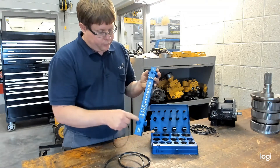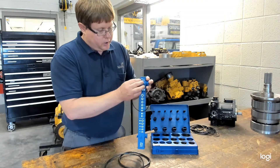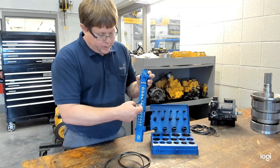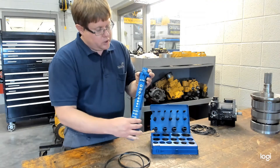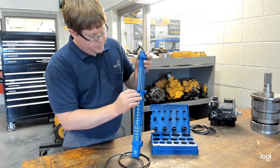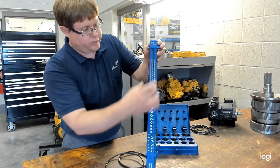On this tool, there are two different pegs. The top peg will split apart, so you'll place the O-ring over that. If it is large enough to reach the bottom peg, you can hook it there and then read that scale. This one, as you can see, is not that large. So we're going to open it up and keep it hooked on both those pegs.